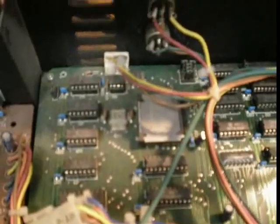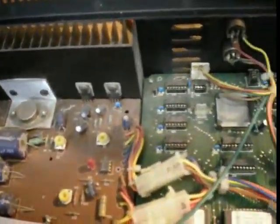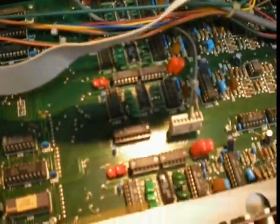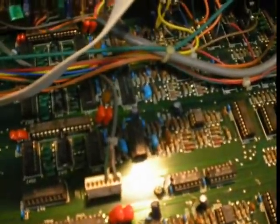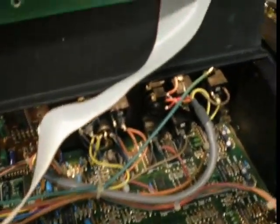And let me get this thing propped up. Of course, all your digital chips there, the CPU is back under that aluminum shield right there. It presses down the chip. Power supply has some adjustments depending on which version it is. They'll have different ones, and all that stuff's in the manual, how to adjust that, and your voice chips, your oscillators, and then there are some comparators and op amps in there for pulse width mod and so on, and then your filter chips,